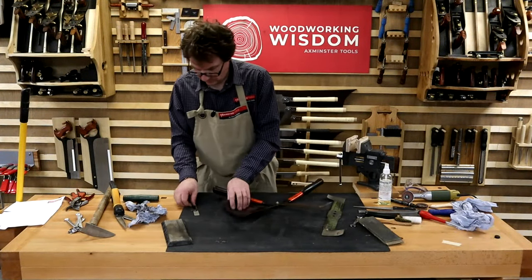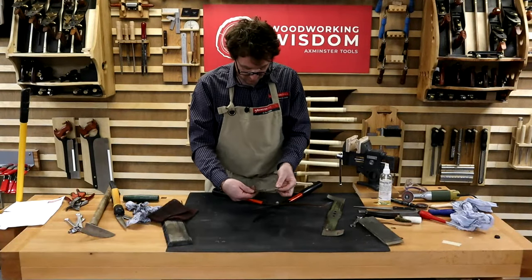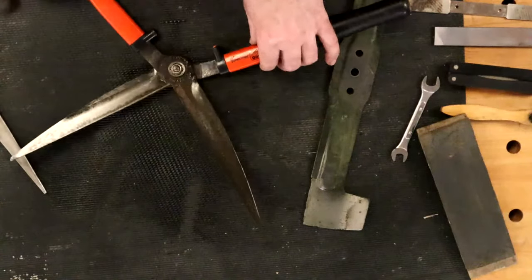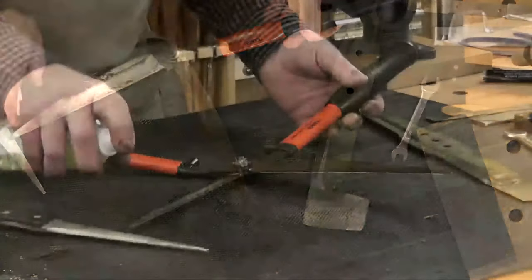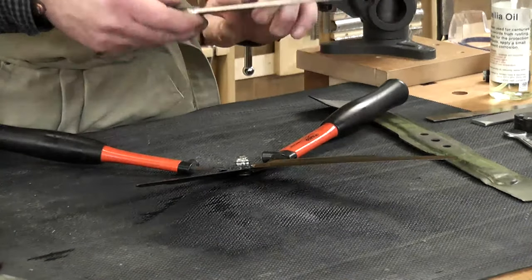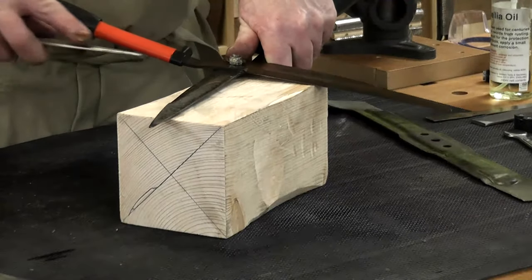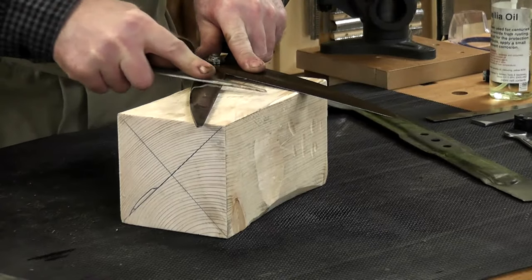In my scenario, I don't want to go get the Tormek out. We're going to go back to our little diamond file. Actually, we're going to go to a knife one, but it's slightly bigger. So this is a knife file diamond sharpener. A little bit of oil to help lubricate it, push it in. So we've got a nice flat side, we've got a curved side. Again, just to help raise it up, to give me a bit of access, I'm going to give us a block we can sit on, and I'm going to come down through there.